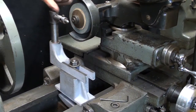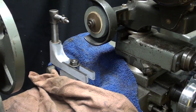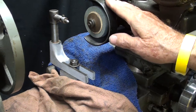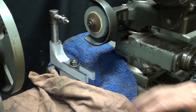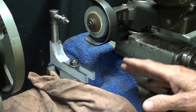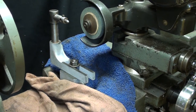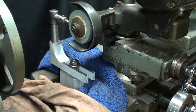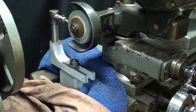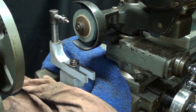The diamond is pretty much perpendicular to the spindle. One of the very worst things for any lathe is to have grinding dust and grit fall on any of the bed parts or the slides. So notice that I have this draped. If I was going to do a lot of it, I would moisten the cloths. But all I'm going to do now is remove a few thousandths off of the wheel by moving the wheel — that is the entire carriage — back and forth against the diamond until it trues up.